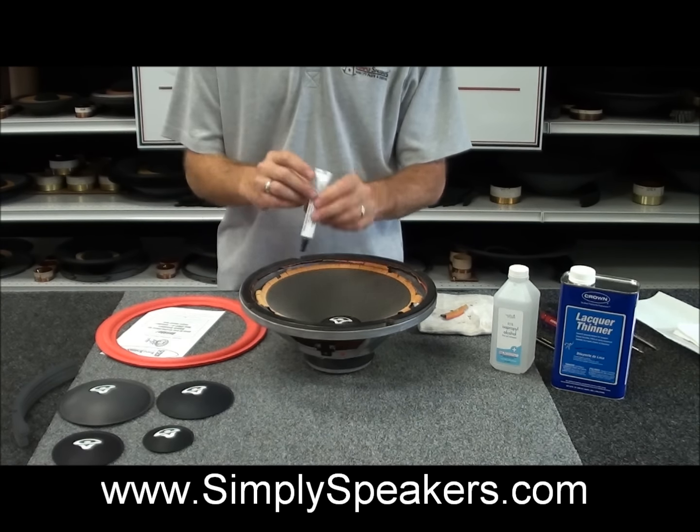And then we have the gasket here with the 4 holes. We're going to set that right in place. Line that up with the 4 mounting holes that you can see kind of through the edges of the new foam there. You have your holes here, here, here, and here. Alright, that's it. That's what you want there. We're going to go ahead and flip the speaker after a moment or so here. Once the adhesive starts to grab, you can hold this down, press this in place, and what this does is it spreads the adhesive evenly around the surround for you. Makes a nice strong bond there.